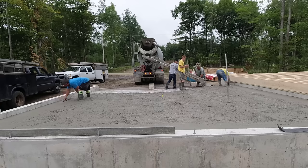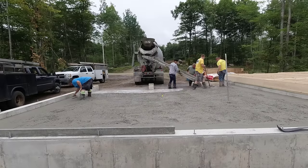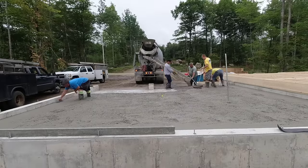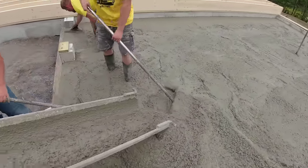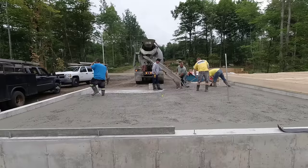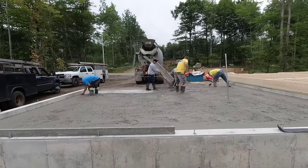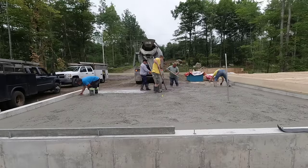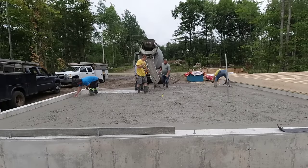So we've got our garage door form set to grade, right to floor grade, so we can screed right off them. We like setting them to grade, and then afterwards, after the concrete sets up and the guys start finishing, they'll taper those garage doors in behind where the garage door sets on the floor. So all those garage doors will have a taper to them. I know a lot of guys will put a two-by down so you'll have about an inch and a half lip that the garage door sets down into. Everybody says the rain's going to blow up under the taper if you don't put that lip there. Well, I've been doing this for 42 years and I've never had somebody say water's blowing up under my garage door just because I only put a taper.